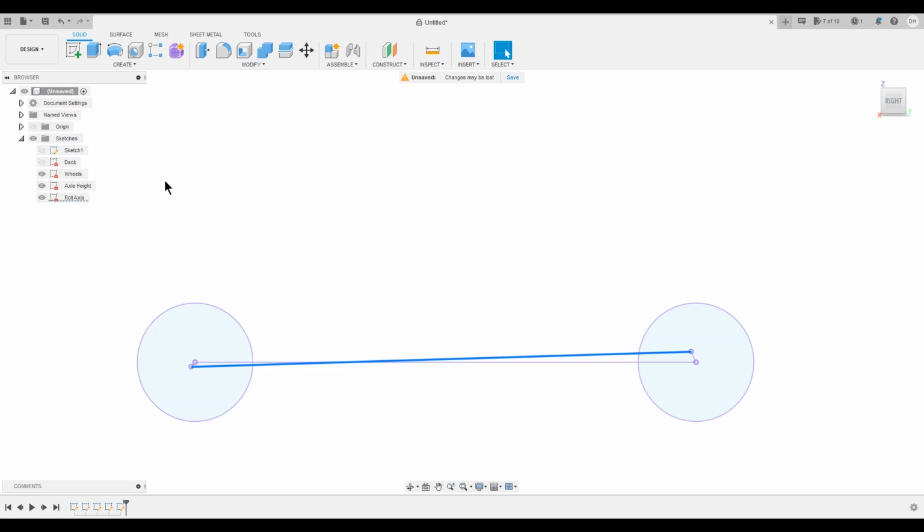And what I want to do with the deck is this. For the rear of the deck, I want to set it up so your rear foot is slightly below the roll axis. So you've got a bit of the hammocking feel of a really aggressive drop deck. Whereas at the front, the deck's above the roll axis, and I'm visualizing this line as being the foot surface, not the bottom of the deck, but the foot surface where your feet are going to go.